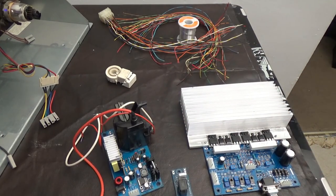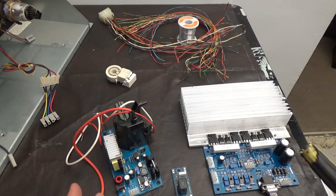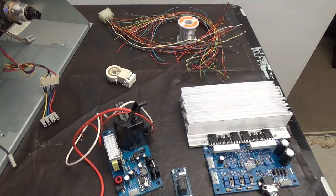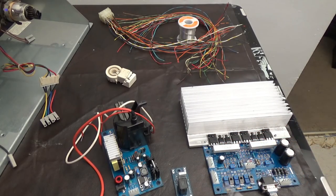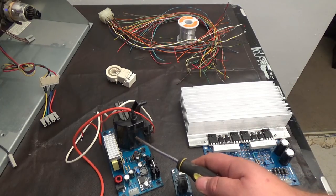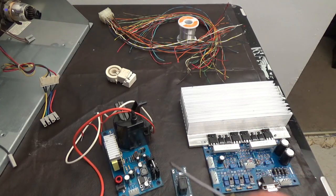Now, I want to talk about some of the modifications, some of the improvements done to this that are different than the old version, Revision 2. First off, my absolute favorite thing he's done: he went with a larger flyback transformer. For a vector monitor it's technically not called a flyback transformer, but there's your flyback. This is larger than Revision 2 and Revision 1.